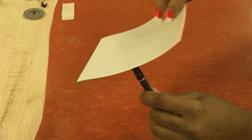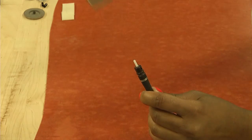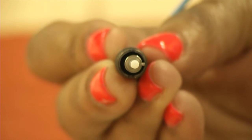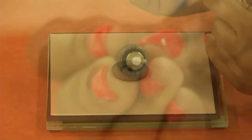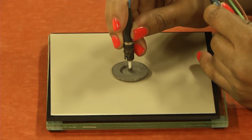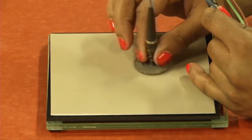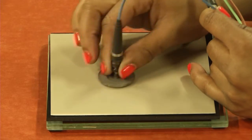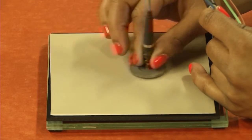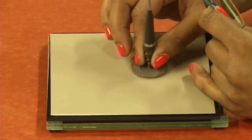Air polishing can be accomplished by holding the connector vertically and the end of the fiber polished off by lightly running the 5-micron polishing paper over the top of the ferrule tip. Insert the connector into the polishing tool. Place the 5-micron polishing paper on the glass plate and start polishing the connector with very light pressure using a figure 8 motion. Do not over polish the connector. Inspect the ferrule tip frequently.